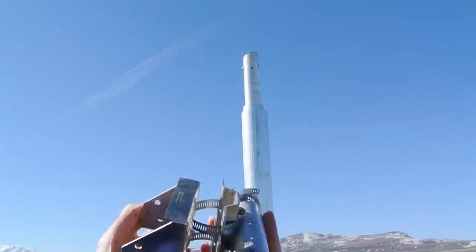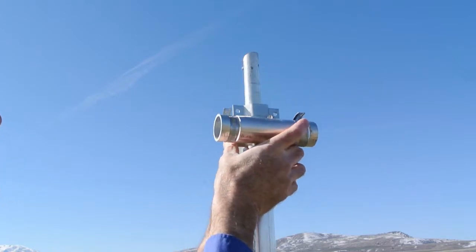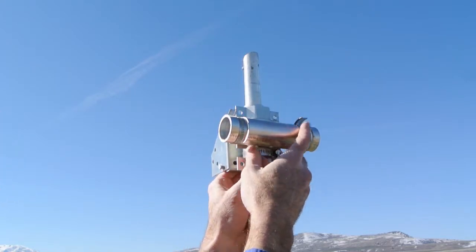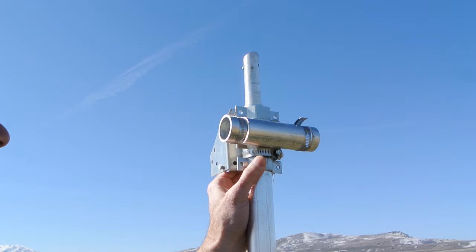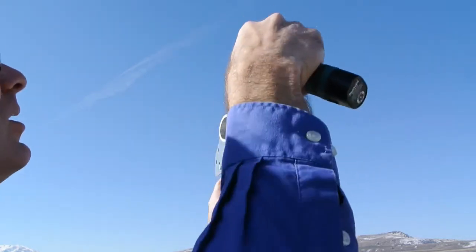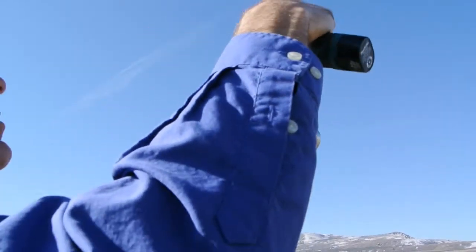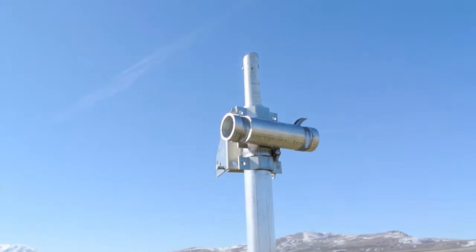The mounting brackets, if tied together, will slip over. We're using a Diacon tripod, but you can use any mast. This is an inch and a quarter pipe. With this in place, fasten the cable clamps, and the crossover is done.